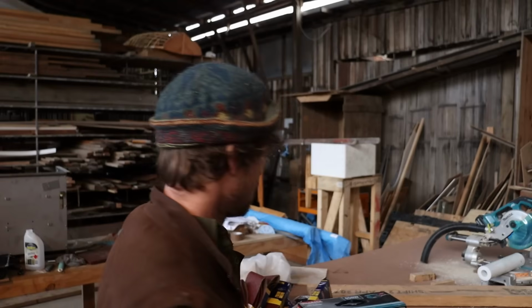Okay, so belt sanding or fairing the hull is very labour intensive, as you may have worked out, but we knew that it was going to be like that, and that's why we put it off a little bit, I guess, but it's got to happen. Holding up this big belt sander is quite heavy. It's a very effective machine, in my opinion, for the type of fairing we're doing. We're not talking about final fairing here. We're talking about sort of an intermediate fair of the hull planks.